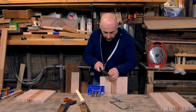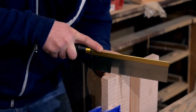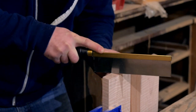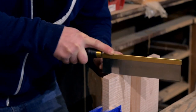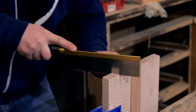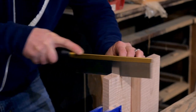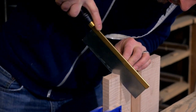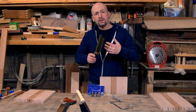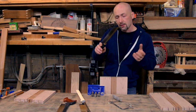So let's go ahead and cut the other side of this pin, and you'll see I can get right on top of it — I'm not far away. I can see very clearly if the teeth are set on my knife mark. I'm going to do a couple cuts. It's a little tougher to get started because I can't throw my weight behind it. When you're getting started, sort of rock it back and then lean in as much as you can with your arm. So you can see I had a little tougher time starting the cut, but I was really able to see how the teeth were set. A good saw depending on how you cut your dovetails.